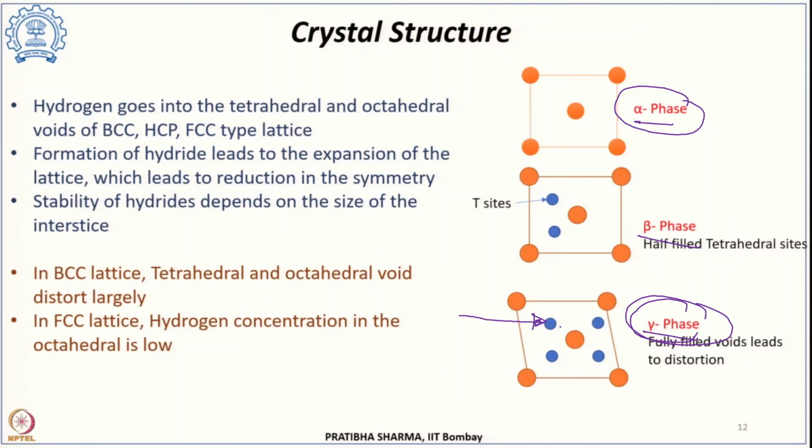And when the hydrogen goes inside the metal, what will happen? It will cause some defects, or generate some stress inside, or distort the dimensions. The dimensions will increase from the initial dimensions because hydrogen is absorbed inside the material or metal, and it will distort the grain, or distort the grain boundary.